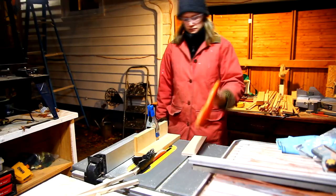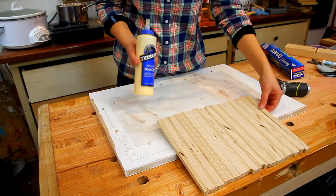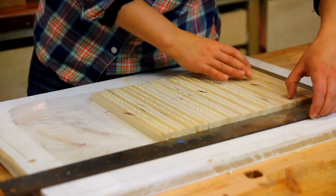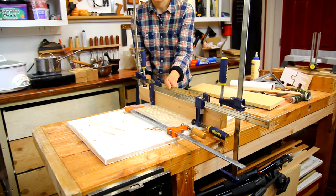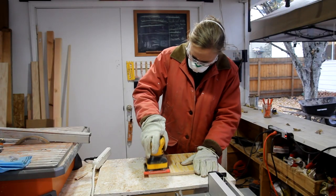Now let's move on to number two: a tray. A tray is the perfect gift for anyone who eats or drinks and doesn't live in their kitchen. For this design, I decided to cut lots of thin strips and show off the plywood that way. I glued them all together, making sure I had good glue contact on both sides. I lined everything up, trying to get my corners straight, securing with clamps. When it had dried, I scraped off as much glue as I could, and then sanded off the rest for a smooth finish.